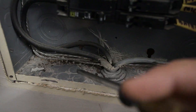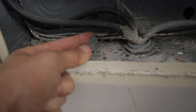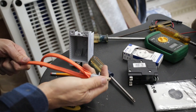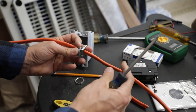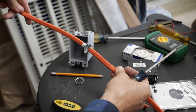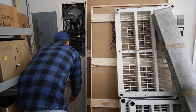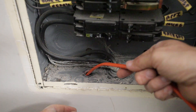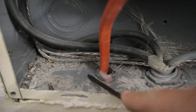Now I have space for my junction box. To remove the tab from the box, you can usually pry under with a screwdriver, get them to pop up, and then wiggle them free. But now we have a frayed edge, so we're going to need to use a clamp here to keep the wire from getting messed up. I'm putting this wire clamp on upside down because it's the only way I can get it to attach to the box without cutting a big hole in the drywall. I'm not sure if this is okay by code — someone in the comments, please let me know. I basically slide the wire through up into the panel, put on the threaded nut, and then screw that down in an upside down position. The wire should be nice and protected once it's tightened down.